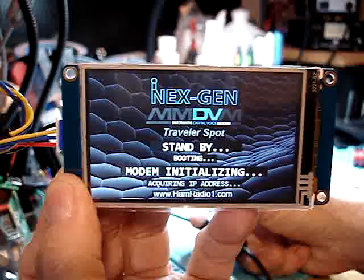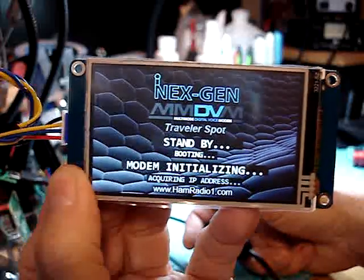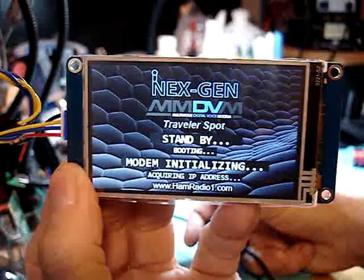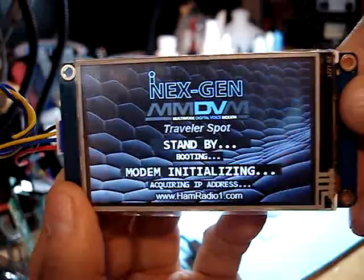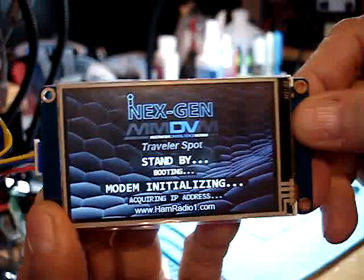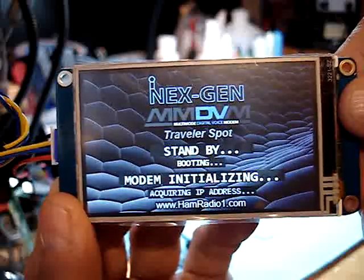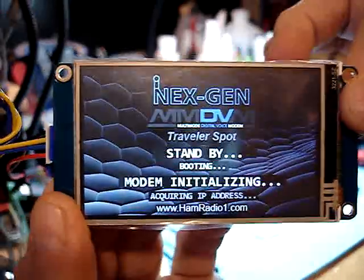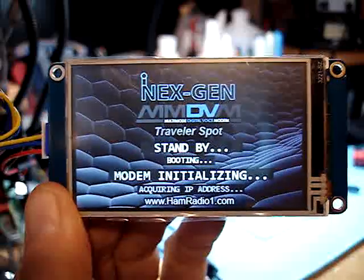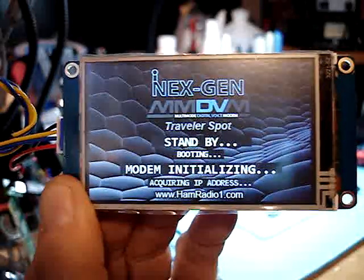Let's put it on again. Looks good. This screen will be powering on and off five, six, seven, eight times through the course of programming. Turn it off and back on. This is how Nexion screens are supposed to program — that's textbook perfect. If we could just get all the screens from the factory that have been truly and genuinely tested and assured that they passed, this should be the normal experience for any Nexion screen. If you try to program one and you don't get this experience, you have got a dud. This is a good screen, and once they've gone through a few iterations of power-up, they're pretty solid. The firmware and hardware is good.